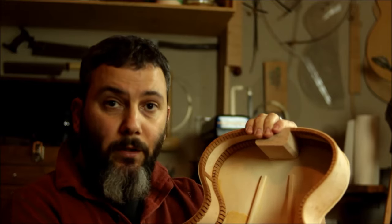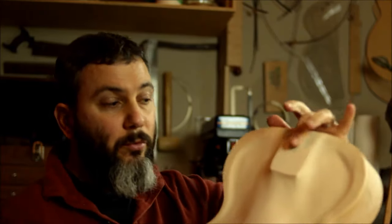I'm sure there are going to be questions in the comments. The first one is usually: okay, so what happens when you sand the top — you already tuned the tone bars and now you sand the top, changing everything you just tuned? Or in this case we're going to be gluing the fretboard onto this section, and when the fretboard is glued I'll shape back to the size of the fretboard — so there's wood removed there, plus the fretboard adds stiffness. What we were doing basically was to create a difference in stiffness. We have a full tone difference right now, and even if we change anything else — sand the top, glue that on — the stiffness is going to increase or decrease a bit, but the whole idea of those tone bars will stay the same, and that's what we were after.